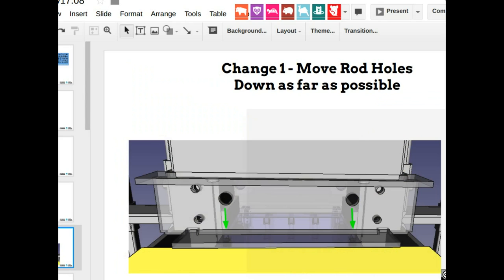And note that the rod making and this hole making can be simply independent. Once the rods are in the right place, and we know the position of the rods, and we know where the holes have to go, so move them down. But at the end of the day, they're independent, because FreeCAD doesn't understand that the rod is going through the metal. You can stick the rod right through the metal and then move the hole to match that.